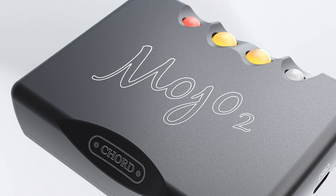Yeah, well, once you've decided to put in a DSP core, putting in crossfeed was no cost in terms of gate count. And it's gate count that's the issue with Mojo, and power supply dissipation. So I really love crossfeed. I couldn't exist with headphones without crossfeed, because it just makes things sound so much better. And I know that some people barely hear a difference with crossfeed, and some people feel like me that it's absolutely essential. So I'm pretty pleased that we managed to put the crossfeed in.